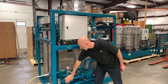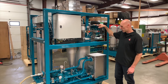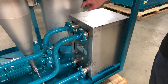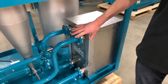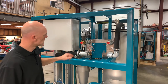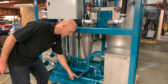On the backside we have an additional control box which houses the frequency drive for the discharge pump. We have our suction piping and our discharge piping. This is the water to air heat exchanger — this helps to cool the air as it passes through the circuit. Down here we have the cross flow heat exchanger; this is oil to oil and it passes the inlet oil past the outlet oil to enhance the efficiency of the heating system and to minimize changes to your oil system temperature. Back here we have our air blower — this is charging the air through the circuit. And then down here is the cyclone, where the moist air will collect and the water will drop out and exit out of this discharge tube.